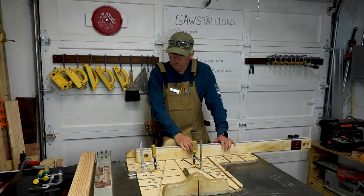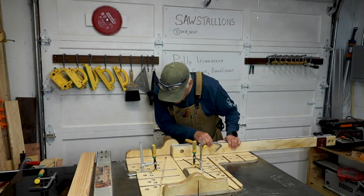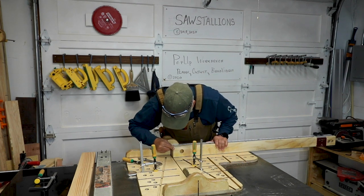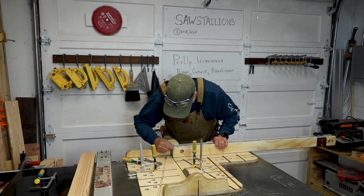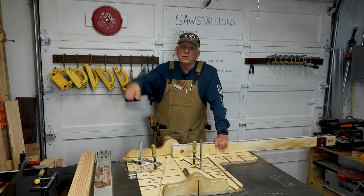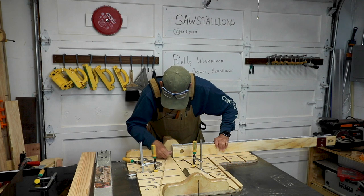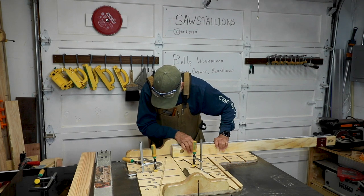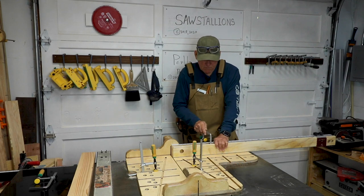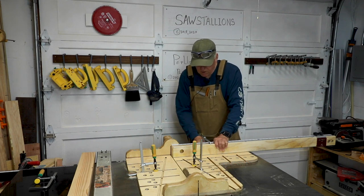So now I have this fence. If I'm going to do 12, 15, or 200 pieces and I need to get them to be 42 inches long — which normally I wouldn't be able to do on this crosscut sled — I don't want to have different crosscut sleds, a big wide one for some applications and then a medium-sized one. I've only got so much wall space. Depending on how accurate I need to be will determine how much time I spend lining up this edge with where you can see the kerf. Most cuts you don't have to be that precise, so get that lined up and then use the Matchfit dovetail clamp from Micro Jig.